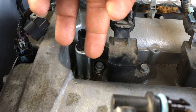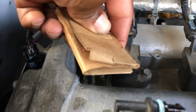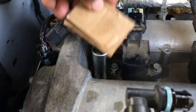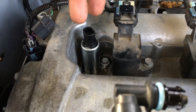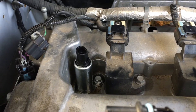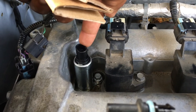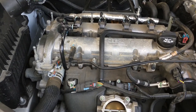You're gonna get a leak. So get some cardboard like this, put it on top of your connector, and lightly tap with a small hammer just enough to make it go down and seat. I'm gonna say it again - lightly tap, don't bang on it. You're gonna break the plastic and you'll have to buy a new one, just wasting money.